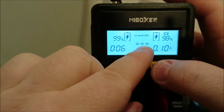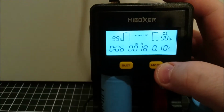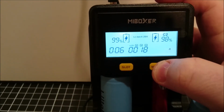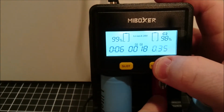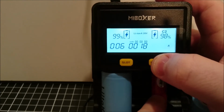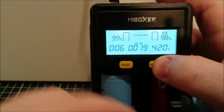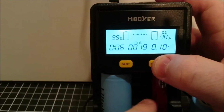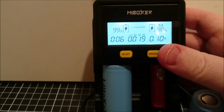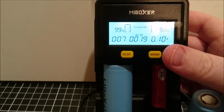And right now you can see it's on, that's how you tell it's on the charge, discharge, and then recharge cycle, like so. And you can still select your charging current, like so, all the way up to 1.5 amps. 1.5 amps is too much for these small cells. I wouldn't push my luck, even though it's an AW, and AW is a really good brand. No, I'm not saying anything against you. I think his name's Andrew Wang. But yeah, I wouldn't charge a small cell that fast. You've got to be careful that the smaller cells can dissipate the heat properly as they charge.